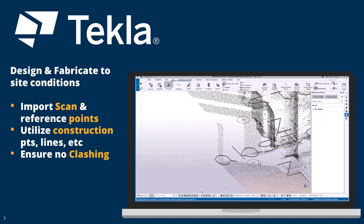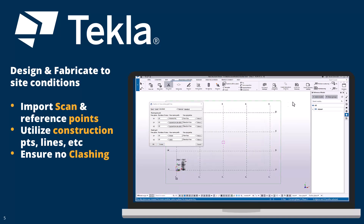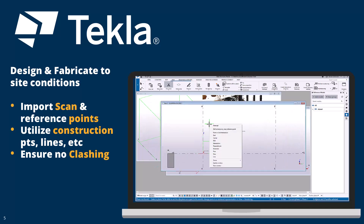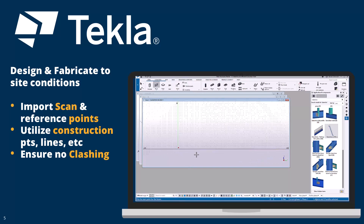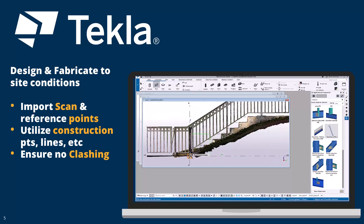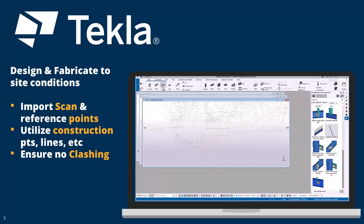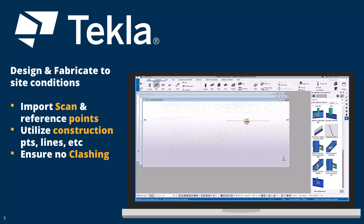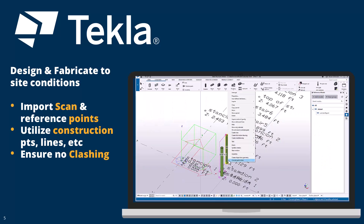It's easier to use clip planes, and within Tekla you have to have a component to pull off of. So create generally a little column. Because everything's already in the correct orientation, I can pretty quickly use my preset views to create elevation and column lines. Then you can actually see I can go in and start to design those stanchions to match the same height as the other handrail that is there. I can pull in off those points, and that's where it makes it a little bit easier. I can trace just off of the point cloud, but having those separate points does make it a little bit easier.